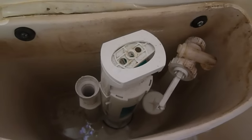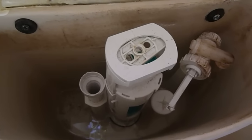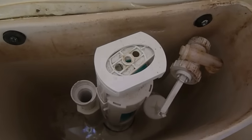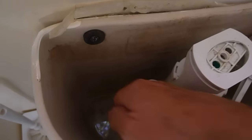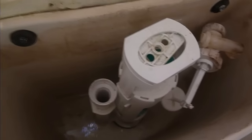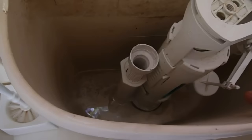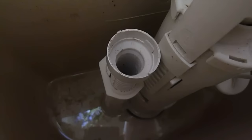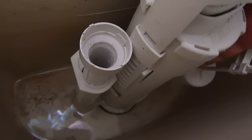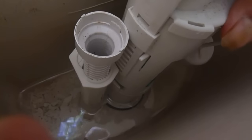I'm only showing you this toilet — this toilet actually flushes and works. I'm just showing you what to do if it didn't. Obviously, if it didn't flush, once the water was off, you'd have to bail the water out with a cup or anything — bail it all out, get all the water out of it. Then you can remove this valve. Some of them have little pinch rails down that you can grab, which will enable the valve to pull out. But this particular one pulls out fairly easily.